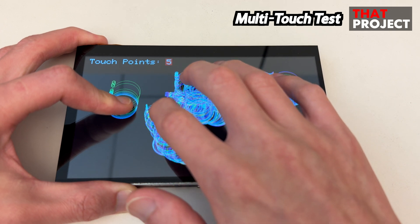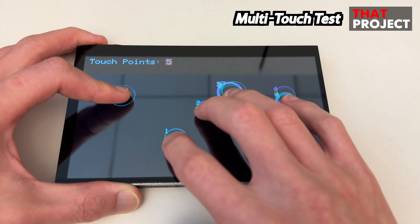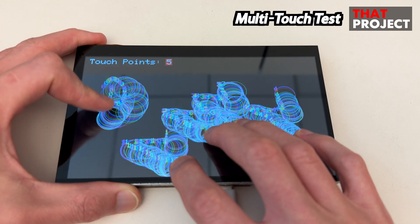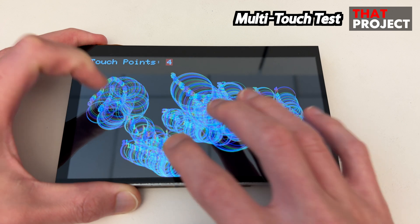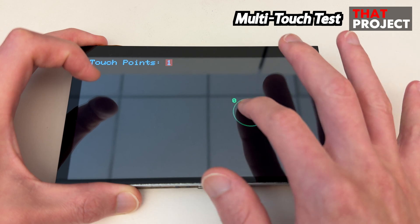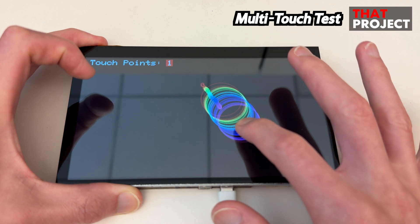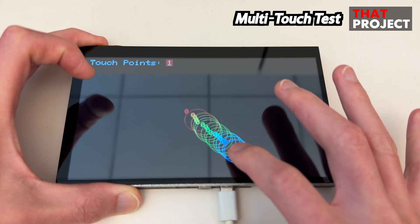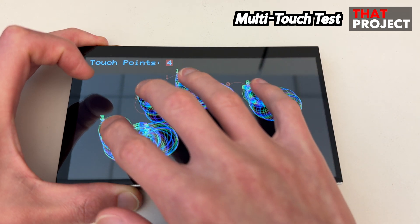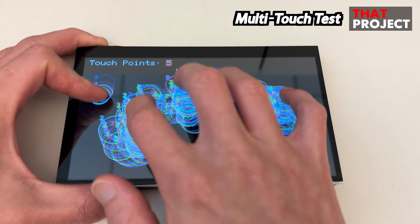This is a 7-inch display, and the touch driver is GT911. It can recognize up to 5 touch points at the same time. I think the maximum number of touch points will be 5 unless the screen is over 10 inches — there isn't enough space for more points on a smaller screen. What's interesting is that you can see the approximate touch size of the touch point when the touch starts. I made a circle when touching to represent the size of the touch point. If I touch it hard, you can see that it starts with a bigger circle. However, it seems you can only see the touch strength at the moment the touch starts, not in real time.